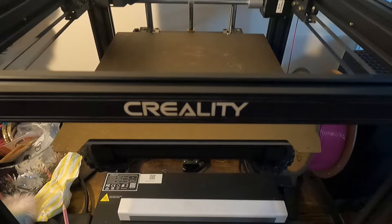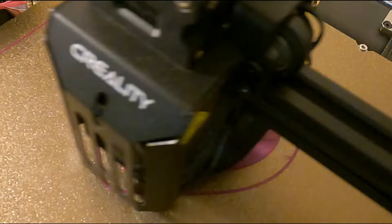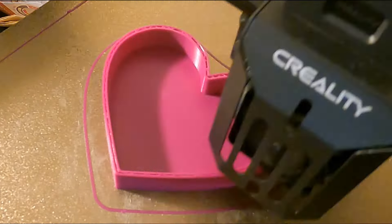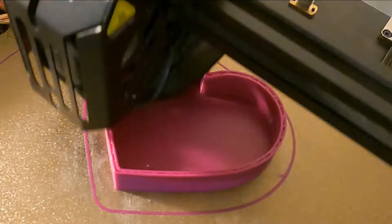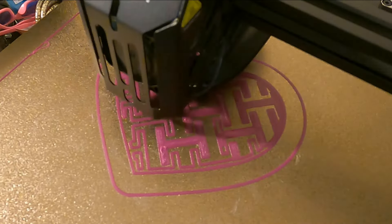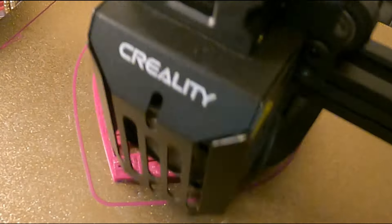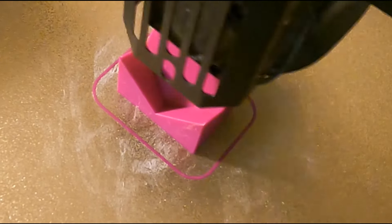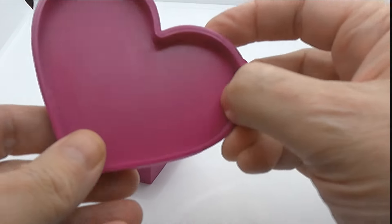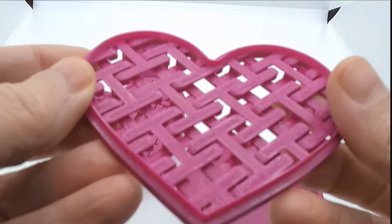I put this on my Ender 5 S1 and this is the hard print. It used to be with filaments — early days you'd get tangles or snags or different sizes — but in over 400 kilograms of filament printed, I haven't had a tangle or any problems with size, so I don't think that's really an issue anymore. This prints well; I printed it at 200 degrees and 60 degrees heated bed, 0.4mm nozzle. I put some glue stick on the build plate — I always use that, especially for something like this so you don't want those little bits lifting up.